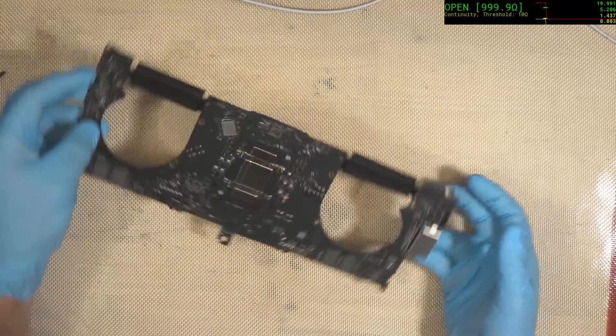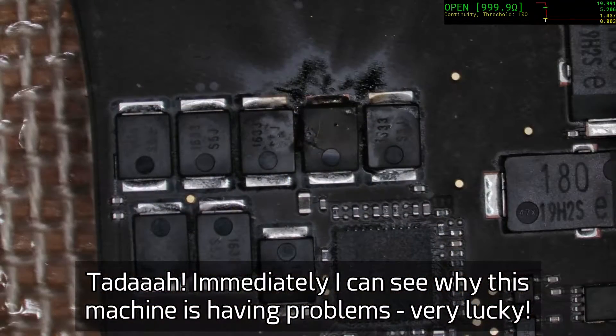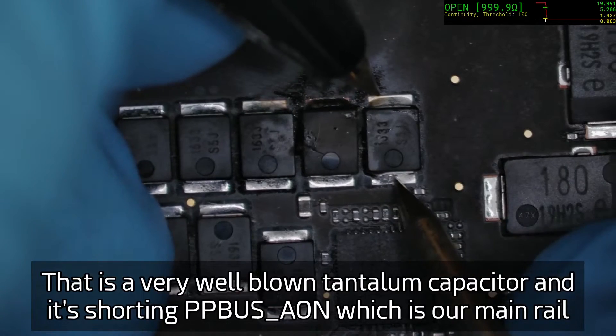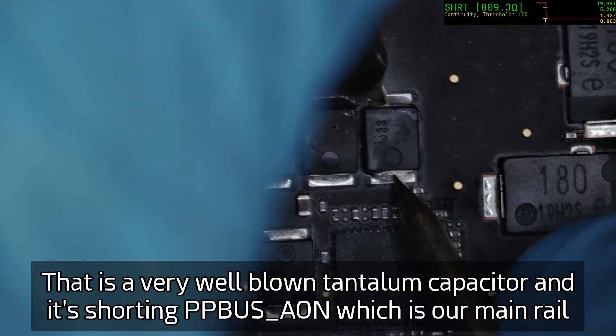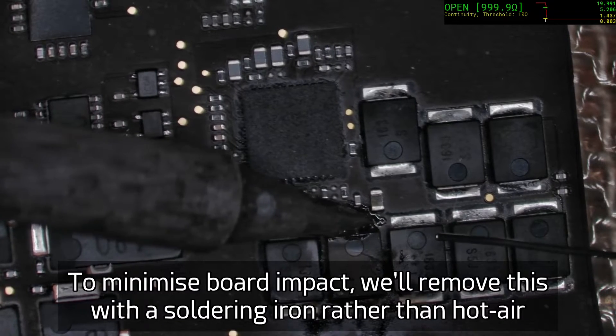Anyway, we get it out, have a look, and straight away I can see what our problems are likely going to be — a big fat shorted, exploded capacitor on what is likely one of the big rails. In this case, PP_BUS_A, which is essentially PP_BUS_G3_HOT for the others.